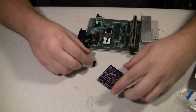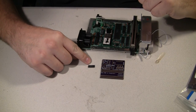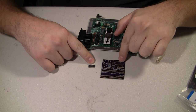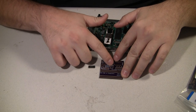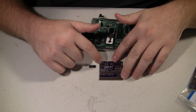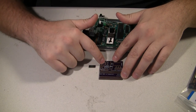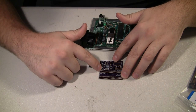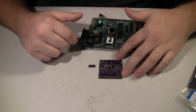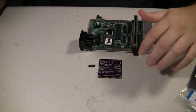So first thing I'm going to do is I have my BA6594AF chip that I pulled from a Super Nintendo. I'm going to place that on the board up here, and then there's two smaller ICs, little 8-pin SOICs, and then there's just the three transistors, and then the rest is all capacitors and resistors. I limited it to 0805 sizes. Anything smaller, it's really hard to do with a regular soldering iron. But I should be able to get all this done by hand pretty easily, so I'll get started on that.